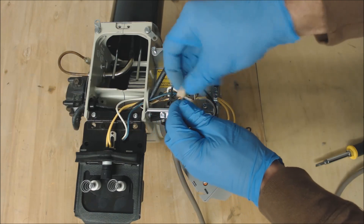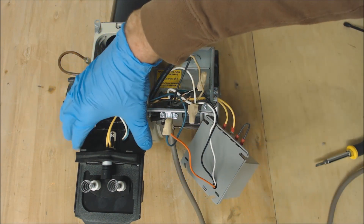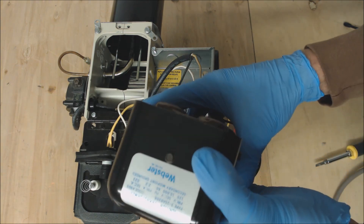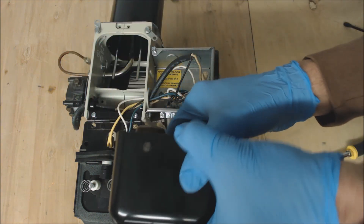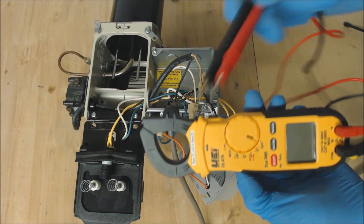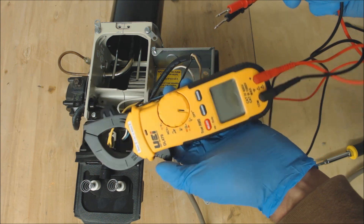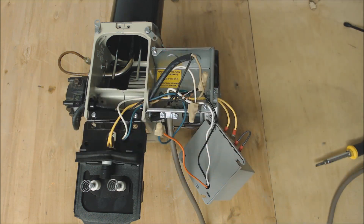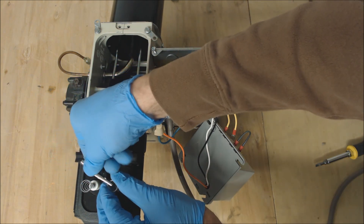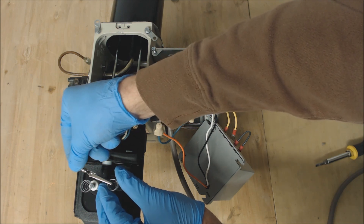What I'm going to do is disconnect the pump — meaning the motor — and also the oil solenoid, and just connect our electronic igniter in. You can have one that's like this, an electronic igniter, or you can have an ignition transformer like this. These are about 10,000 volts so this one is a little bigger but you're going to test them the same way. You don't want to use a multimeter to test for 10,000 volts — normal multimeters are rated around 600 volts, this one is 1,000 volts, but either way do not use a multimeter for this. I'm going to put an alligator jumper on one spring and check the spark gap. That's a rather wide spark gap so I want to bring it in a little bit closer but also further than about an eighth of an inch — right about there is good.